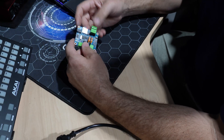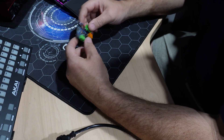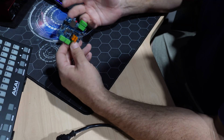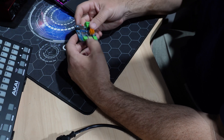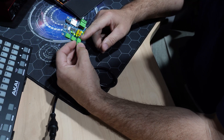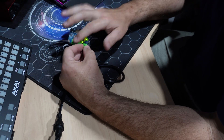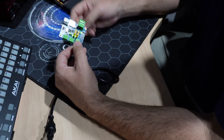I hope that helps you set one of these up to play basic sequences on props. You can set up a sequence and literally just have this play standalone — you only need to run power to it, no WiFi or controller connections needed. It takes 5 or 12 volt input: I was powering it with 12 volt pixels here. Whatever voltage you put in — 5 or 12 — it puts that same voltage out the pixel ports. No voltage step-downs needed. It's really simple, and I hope this helps.